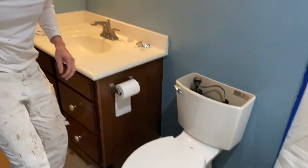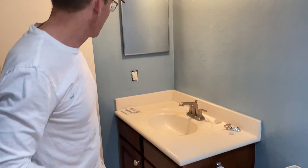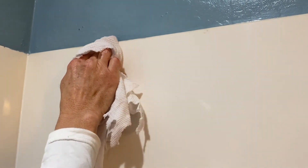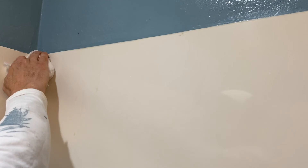While pulling the masking materials, start up high and do the floor last. Pay attention to anything you see that you need to come back for touch-ups at this point. Now is the time — right away when you see something — to use a clean rag and wipe it off before it dries. Super easy to catch this sort of thing right away and take care of it.